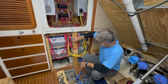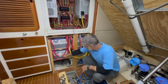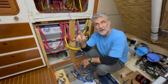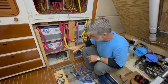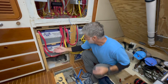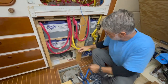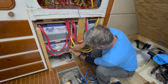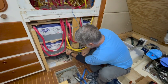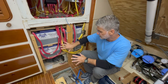The middle beam is loose but not fully out yet because of the wiring. The first batteries I'm going to test are accessible right here. Per ABYC guidelines, I have a board recessed in here that holds the battery from going forward, a board that holds it from going up if the boat were to tip over completely, and boards on each side on the bottom. I've trimmed these boards exactly to size — the battery can't even move a sixteenth of an inch. No matter where we are in pitching seas, these batteries are bolted into place.